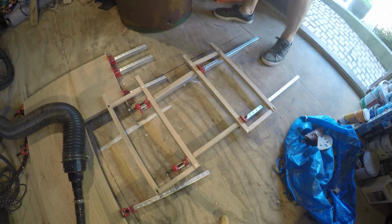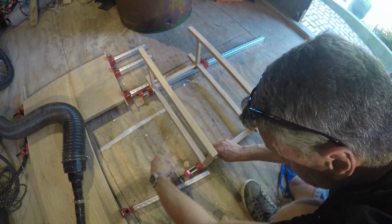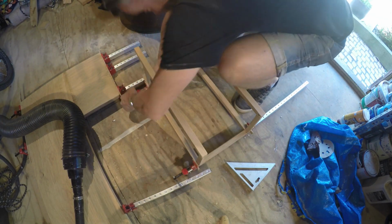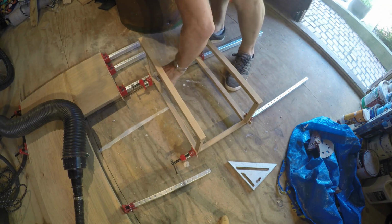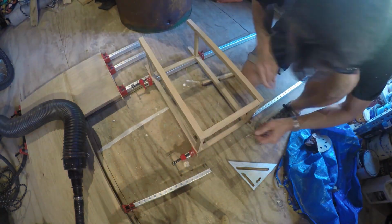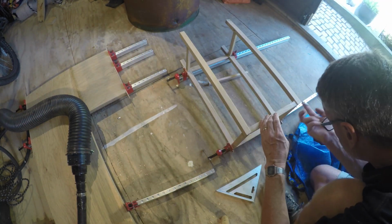here we are at the glue up stage, which I sort of do on the floor because I've got more room and I've got all these big clamps. Before I did this glue up, I did have to get my chisel out and tweak all the little joints so that they sat flush and deep enough, and there was a good shape to them. But I cut all that out because you don't want to sit and watch me take millimeters of wood off with my little chisel. So anyway, I've gone straight to this glue up sequence now, which obviously takes a lot longer in real life because you can see I'm going backwards and forwards to the bench just to try and make sure that everything fits nicely.